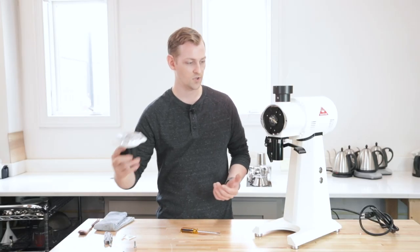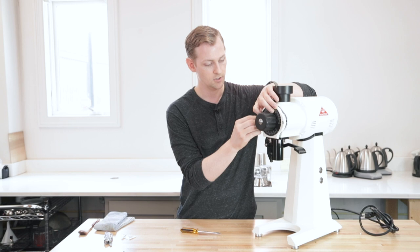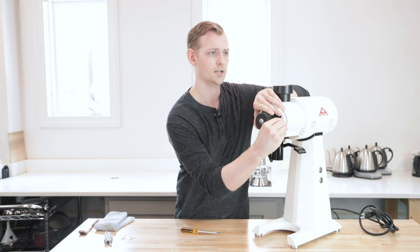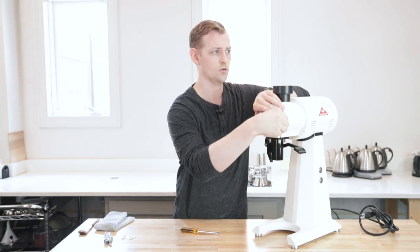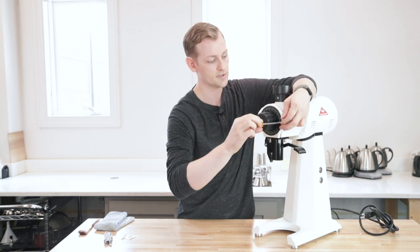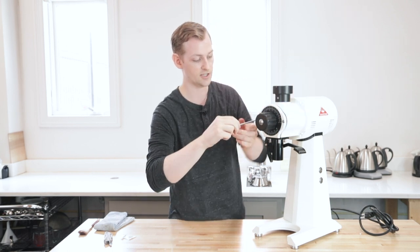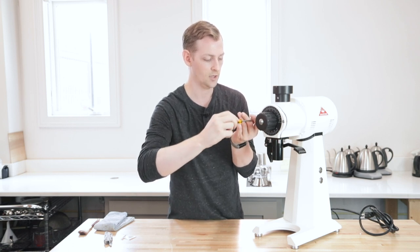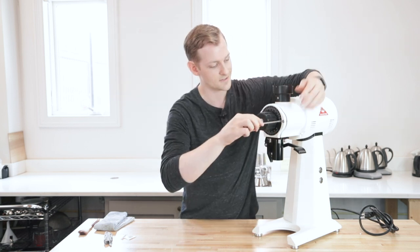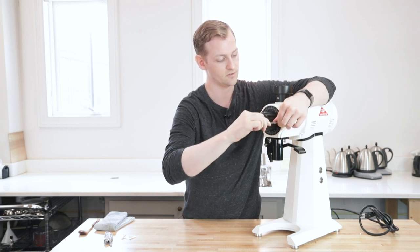You are ready to go. Just install the front cap of your grinder again. We have a couple of screws to screw down. I do like to alternate screwing them down when putting the front cap back on. Partly that's just so it's easier to screw both sides in, because if you do one side all at once there is a spring pushing back against the cap, so it can put it at a strange angle that makes it harder to screw down. So just a couple of turns on either side, and make sure it's lined up properly and coming back in straight — other than that, very simple process.